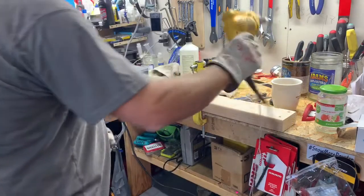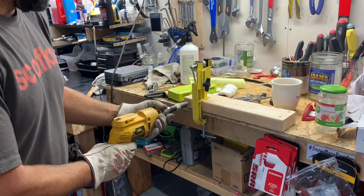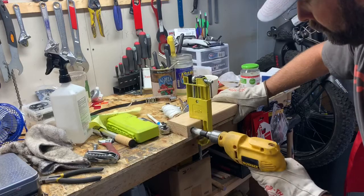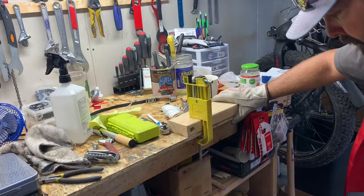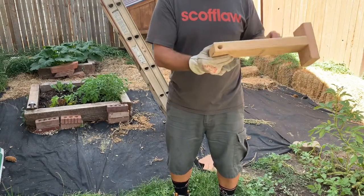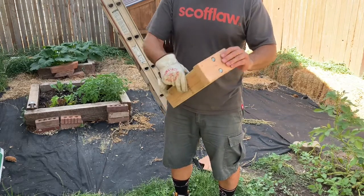I'm going to put a 19 millimeter hole into this wood — this will be where the antenna sits. Pretty basic little mount: a hole for the J-pole, a couple of holes for cable ties, and I used some lag bolts to make this thing really sturdy.